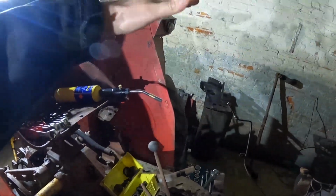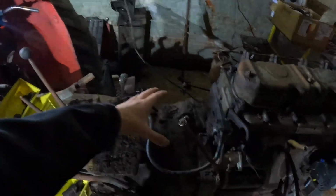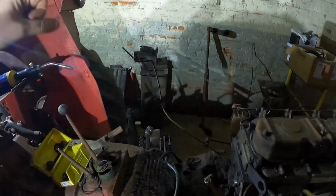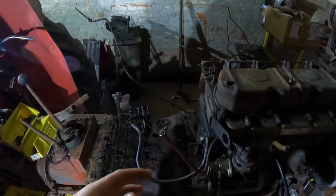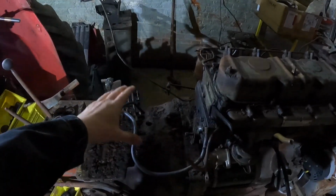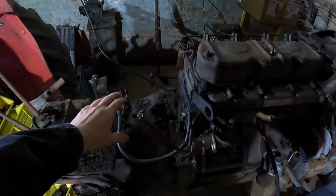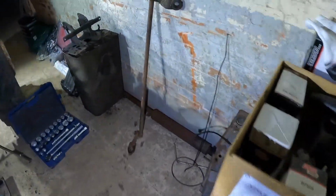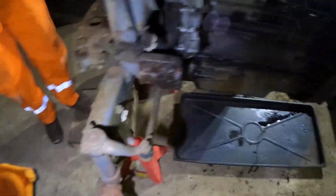So we thought, well, obviously there's something wrong with the steering. Steering wheel being here, and down to there, there's where the box sat. That had rusted through, fair enough, but that shouldn't have just broken off. You could hardly turn this, to be honest, hence why it broke. So that was full of gunk. And you've got your steering arm this side, which is there at the moment.